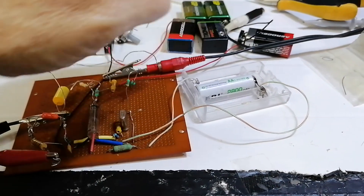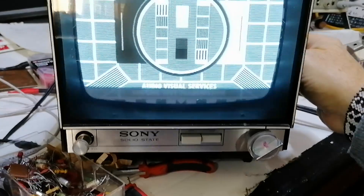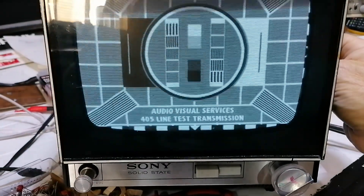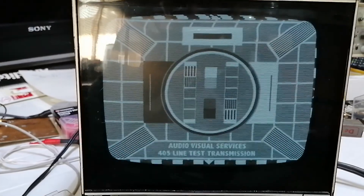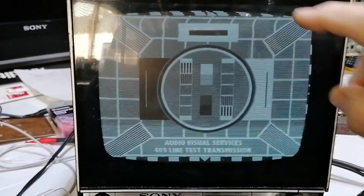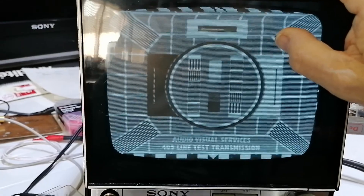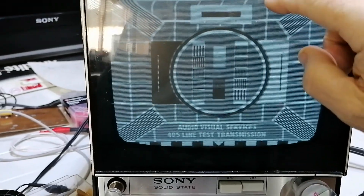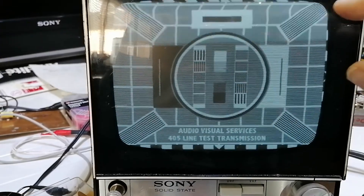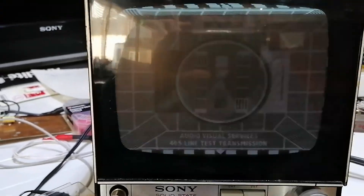And there's the result. Unfortunately the phone will band — it's just the shutter speed isn't very good. What we can do is bring down the brightness and hopefully the contrast enough for you to get the idea. That's the result — very good, very pleased with that. A little bit of bending at the top. We need to check the DC — there's no DC restoration as such, so we need a DC path for the video to get black level right. The syncs are probably not particularly wonderful at this time — this was just a quick test to see if it would work at all, and it seems to be getting good results all the way from the bottom to the top.